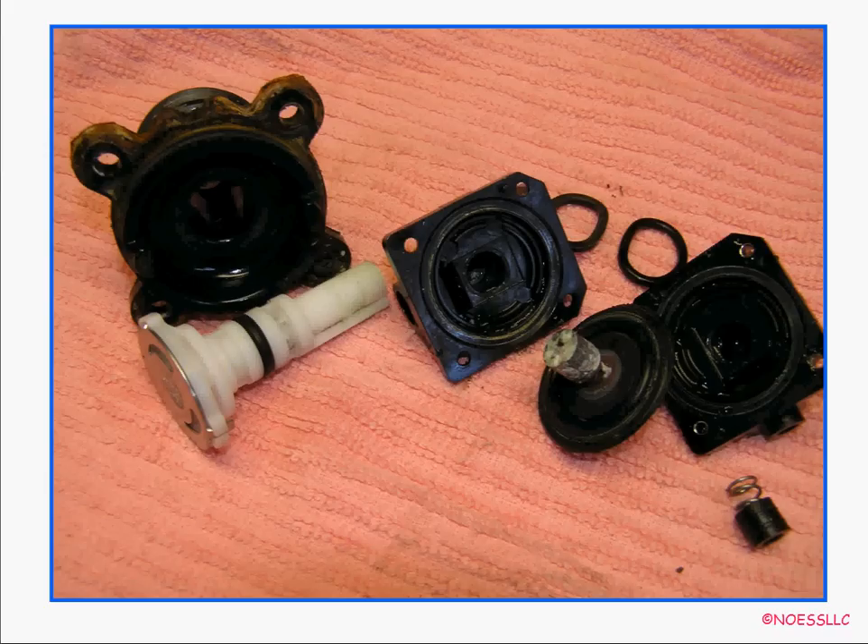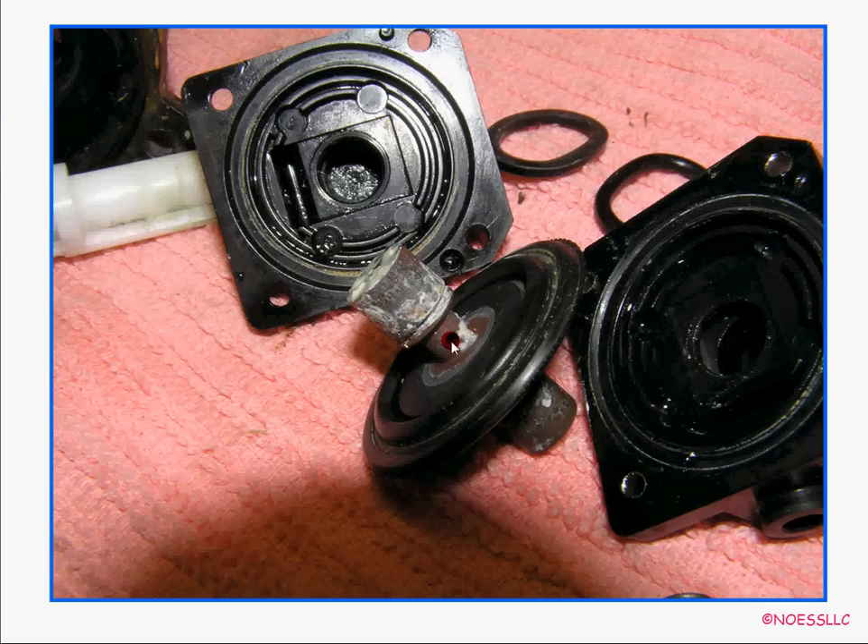Just for the terminally curious, like myself, I decided to pull the old valve apart and see what was going on. This ring right here was leaking after 10 years. I drilled out the rivets so I could pull it apart. Inside there's a little unit with a hole on each side — one side is the hot and one is the cold — and there's a little rubber diaphragm. After 10 years these things were so corroded that they couldn't move back and forth. It's supposed to move freely so it equalizes the hot and cold pressure. After 10 years I guess that's pretty good, really — but it can get pretty corroded and the valve just doesn't work very well after that. Kind of interesting to see how well this was engineered — it is pretty clever.